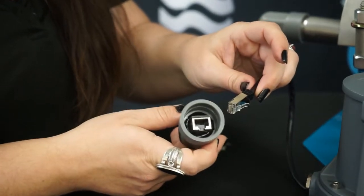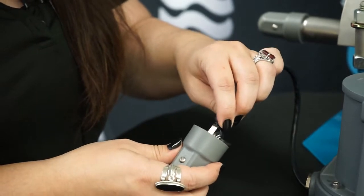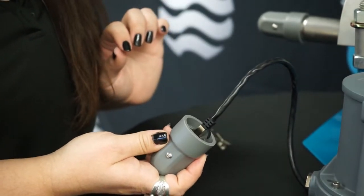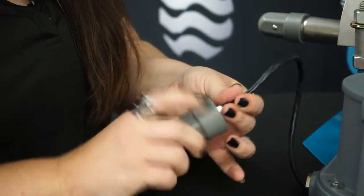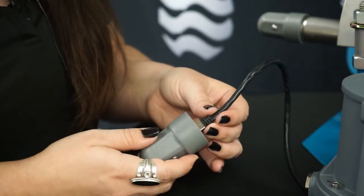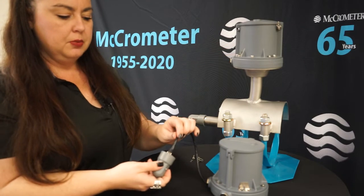It's great because it's a very easy hook-in — it's an ethernet cable, the CAT 7 ethernet cable, and everybody's pretty familiar with how to plug one of those in. It really takes mag meter technology and simplifies it because it's a simple plug-and-play, and the sensor threads right onto the elbow off of the saddle.